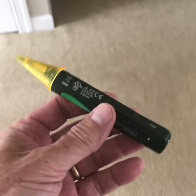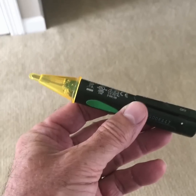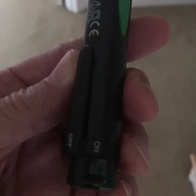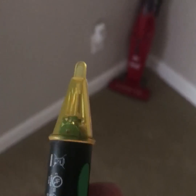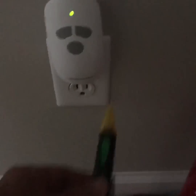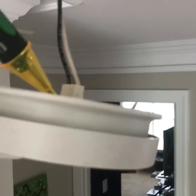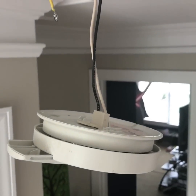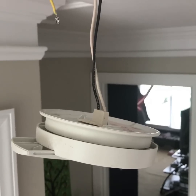You're also going to need a voltage tester like this one. I'm going to put it into the on position. Some of them have a flashlight function so you know when they're working — this one doesn't, so I need to plug it into an outlet to confirm it's working. Now I'm going to go up the ladder and verify that I have a live connection. I can confirm there is live power, so now I'll go to the circuit panel and cut off the breaker.